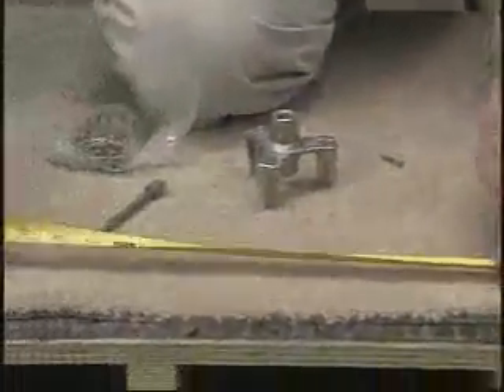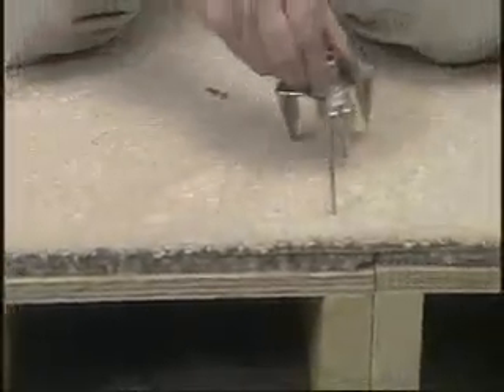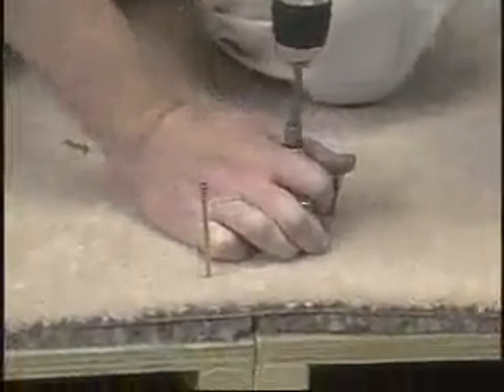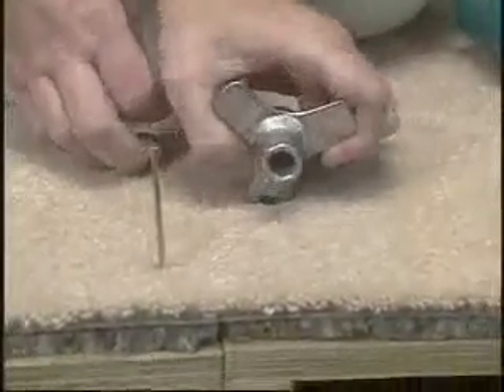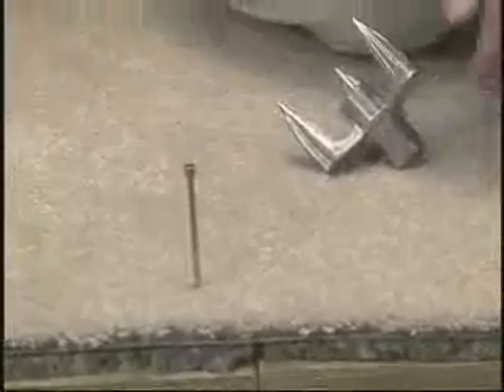Just take it, uncouple it, and if you have squeaks across the room, take the tape measure, hook it up to that spot, and measure in increments of 16 to find all the joists. Over the joist, place the fixture, take one of these specially scored screws, and drive it down as far as the fixture allows. When the cam's out, it's set. Place this over the head and snap it off. You'll never know in your carpet where you went through, and you'll never feel it because it always breaks below the wood of the floor.